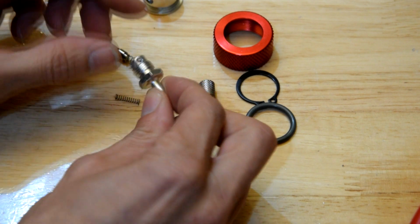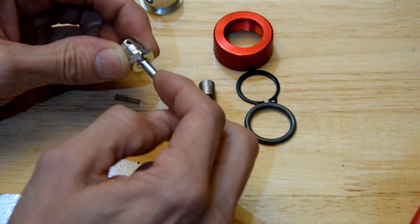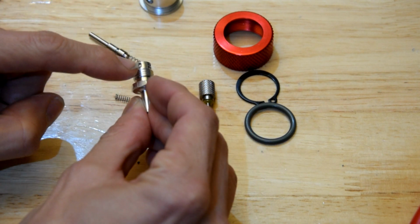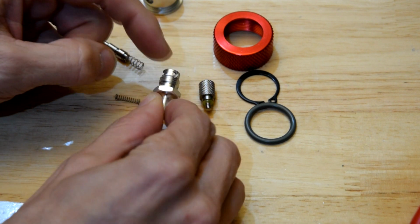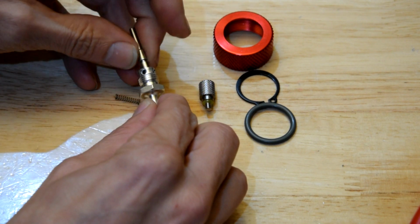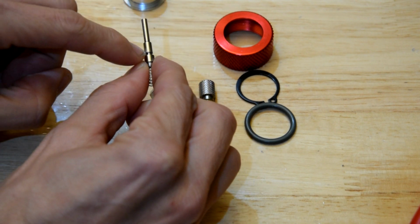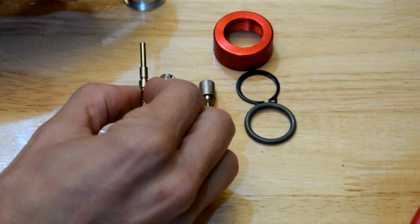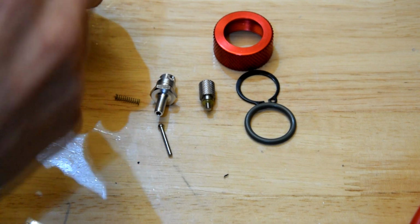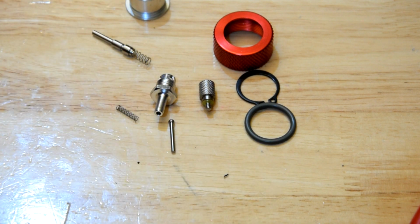That then allows the gas to flow not only just through the middle of that, but around this and through these holes in this piece into the center of this pin, through these holes here, and then out the hole that way, and then it's sealed via a rubber gasket inside there, and there's all these springs that hold it all together.